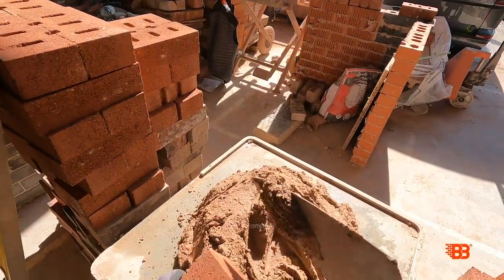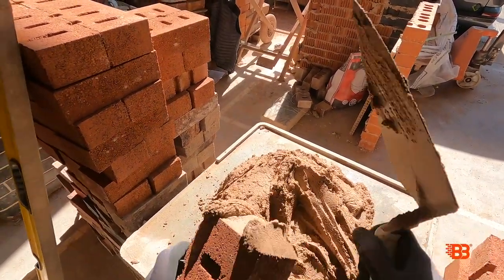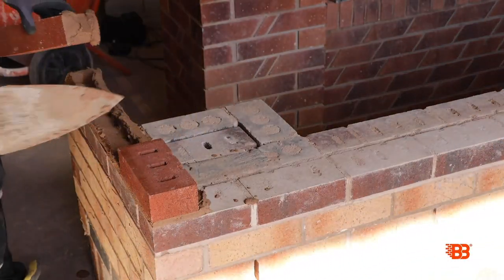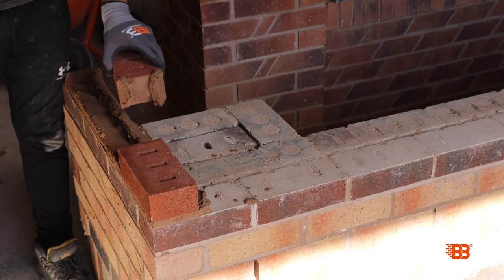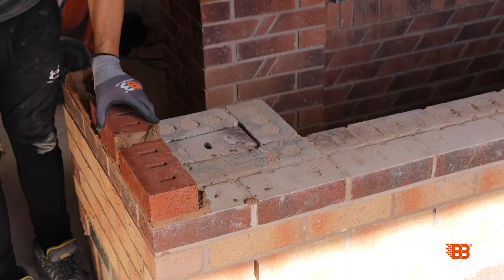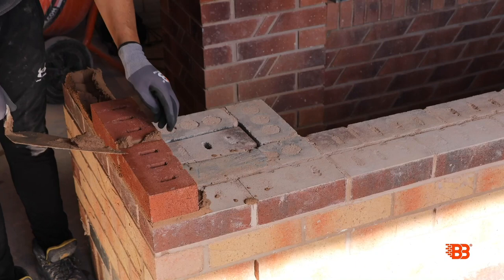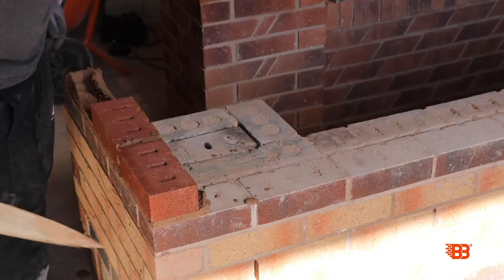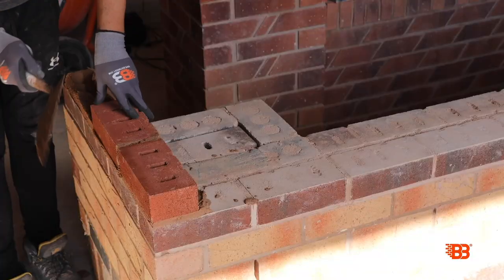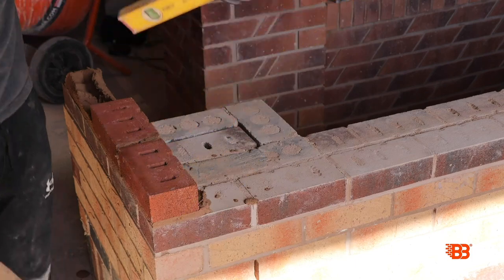Into the board, flatten it, down up, right, left. If you need any more — I just need a bit more — put a bit more on. Pushing onto that. Get that aris matched up. Cutting, collecting, back on your board. Get the aris matched up. And then we can level that through to our gauge brick.